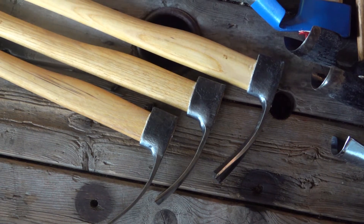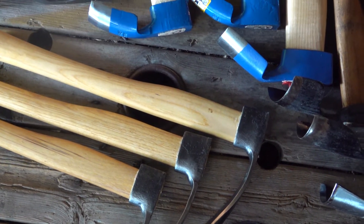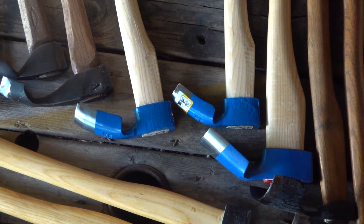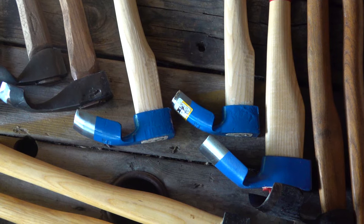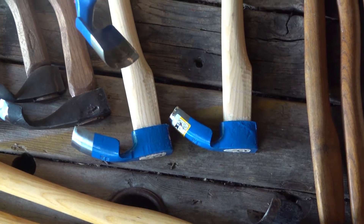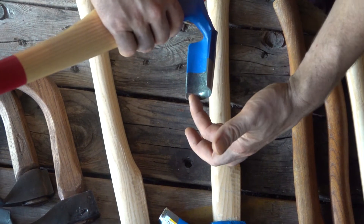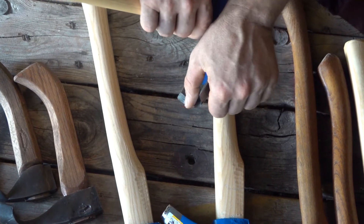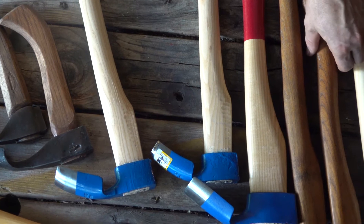We're talking about the inside bevel but also all of the bevels. Mueller also has their French design, which is again going to be your inside bevel, offered in three different arcs. I don't necessarily know if those would all be counted as gutter adzes, but they're not quite straight. The Mueller classic Swedish design has the outside bevel, and that's really what distinguishes it. I've also got a Stubai here — good quality Austrian steel, still forged, and it's going to have that inside bevel as well.